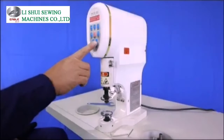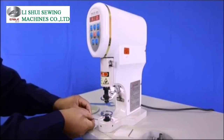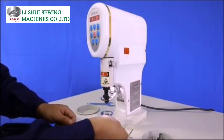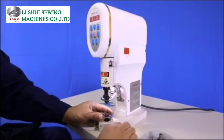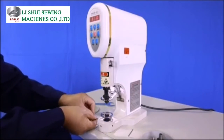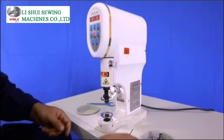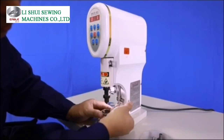Regulating the safety ring: please adjust the menu on the control panel. Now, loosen the lower protective ring and adjust the lower ring with the lower die, then fix the lower ring. Keep stepping down the pedal and unscrew the upper protective ring.